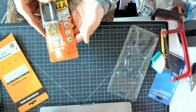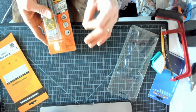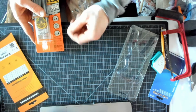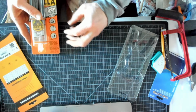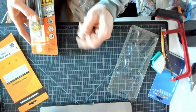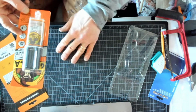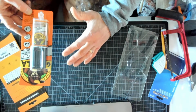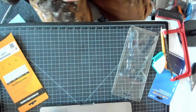You will feel it get warm if you're holding on to a piece of paper or something, for example, that you're mixing on. But I'd want to hold a stick, not a toothpick, but like a popsicle stick, so that you can whip this stuff around for about a minute and mix it up. And as you're whipping it, you'll see it turn. It won't be opaque, but it'll look kind of cloudy, like you won't be able to see through it when it's first going through the reaction. And like I said, it dries clear. All right, so this will stick to anything, anything. And if the surface you have is something super smooth, we would take a little piece of sandpaper, even fine sandpaper, and just kind of rough the surface up before we apply this, so that it gives us the best chance of adhering to the surface.